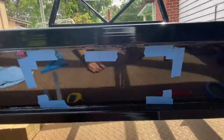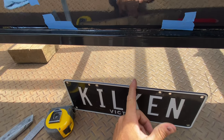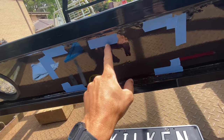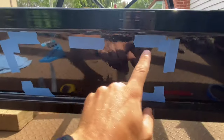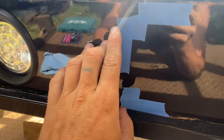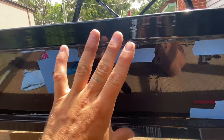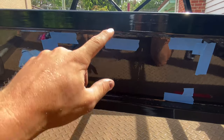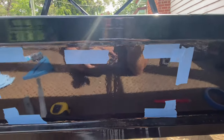All right, license plate — center mark from both ends. I just measured what this is, found out what half of that was, then measured half to the two outsides and did a little line on either side. Then I measured the gap and the height, took away the height of the plate, and divided by two — that leaves equal gap on top and bottom. I marked them and then just held it there and marked the holes for it.